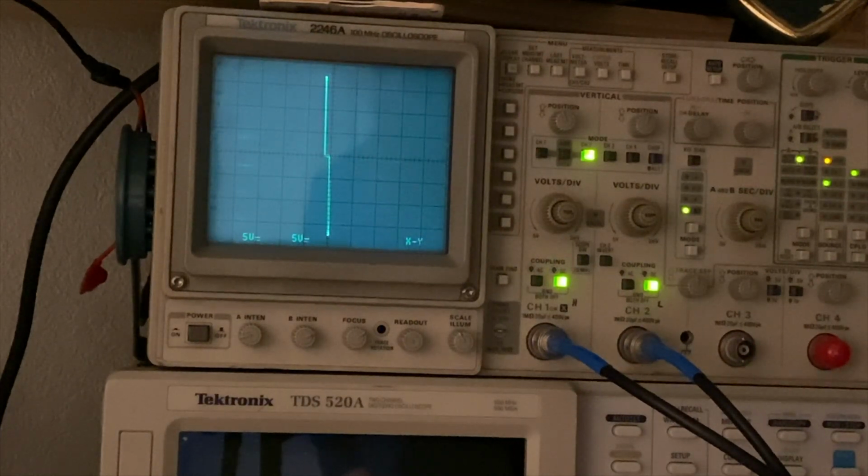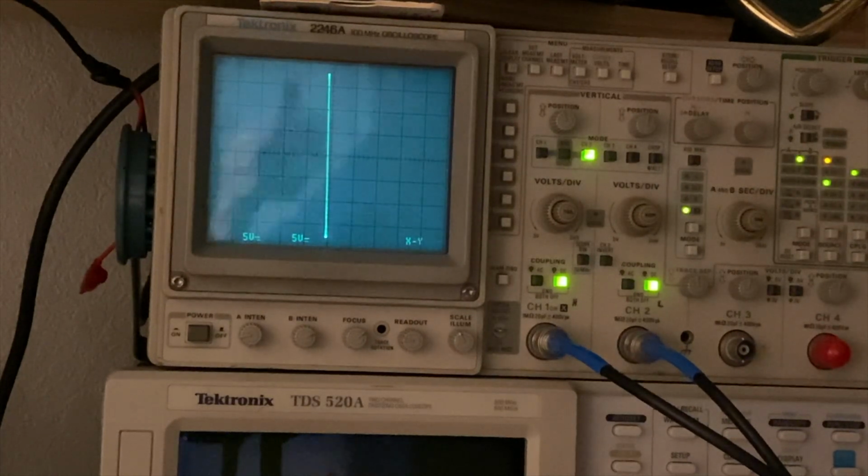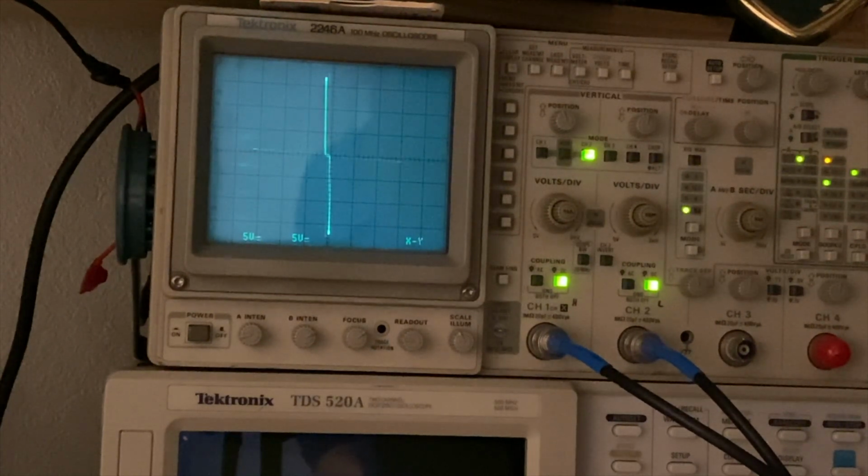Pin 2, that looks good between these two ICs. Pin 3, you can see there's an obvious difference there. Pin 4, slight difference there. Pin 5, no difference. Pin 6, definite difference, one side is shorted. Pin 7, little difference but not bad. Pin 8, pin 9, big difference there. So this is the left, right, so two different puppies there.